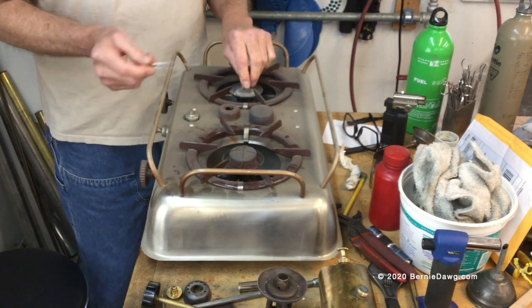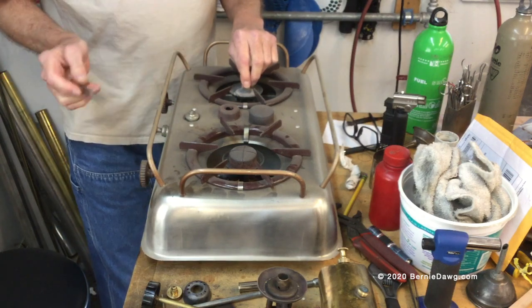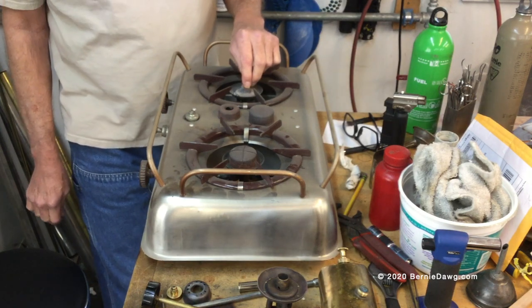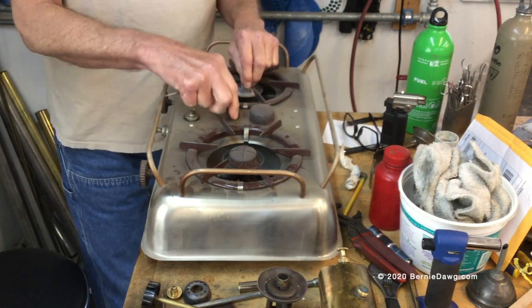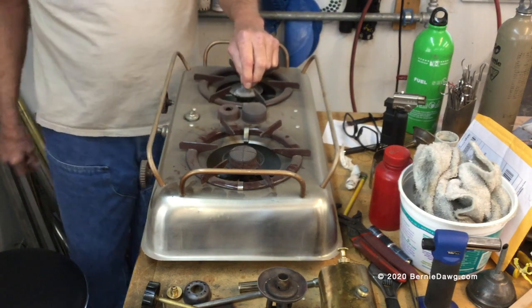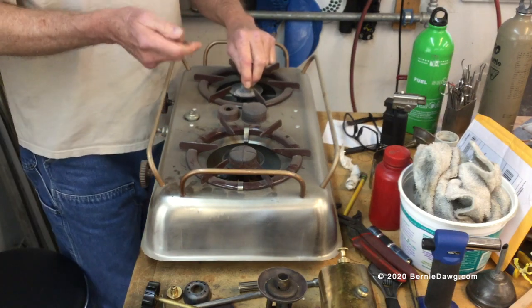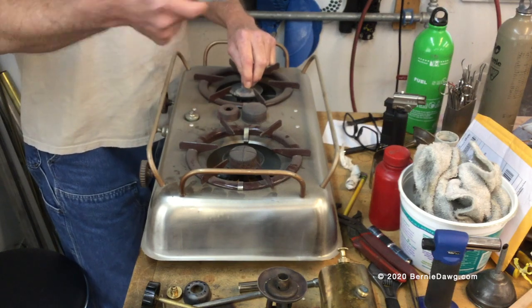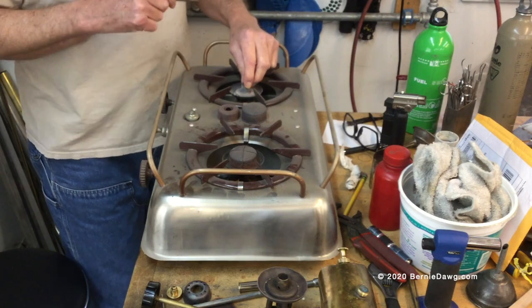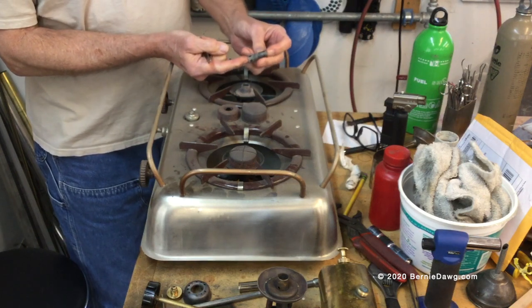I have a whole other video featuring this stove—you can see it by clicking the box in the upper right corner. If you get the model with the kerosene burners, they can be converted back and forth from kerosene to alcohol by simply changing jets and using an alcohol restrictor tube. Alcohol jets are hard to come by, and this is a good source for them. There's also a supplier still in existence, but it's hard to know how long they'll have those alcohol jets—I'll leave a link in the description below.